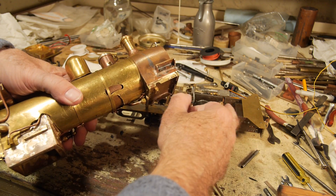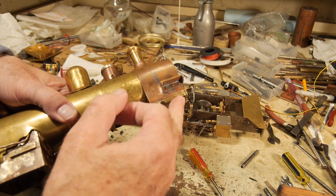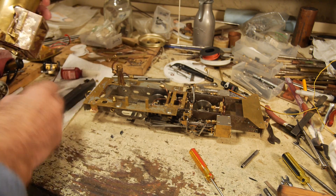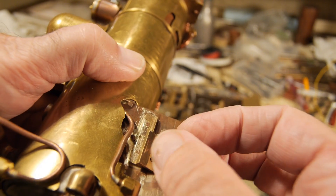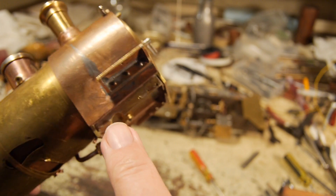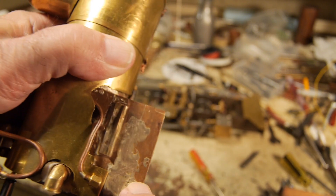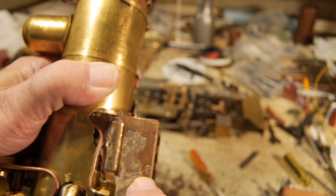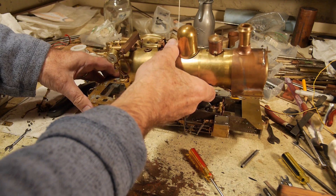I've got fixing at the front end which is solid where the smoke box is, and then I've got a sliding joint here. You can see it if I bring it up into close-up - it's a sliding joint, fixed at the smoke box end. But it has to slide at this end because the boiler will expand as it gets hotter. If you fasten it into the frame solidly, it's going to break something in the end.